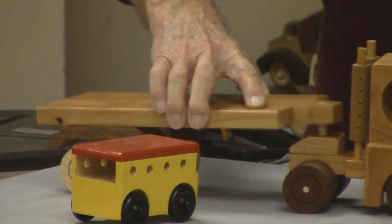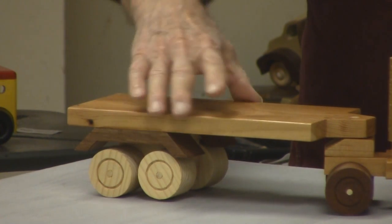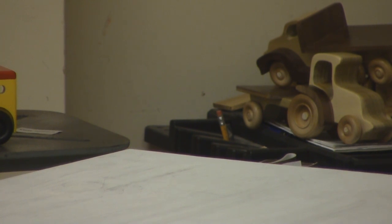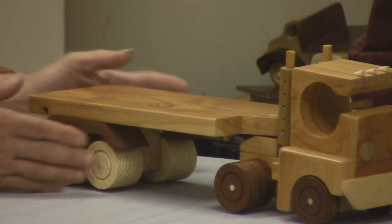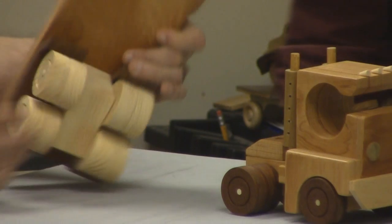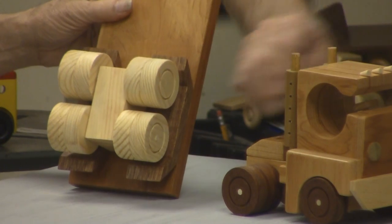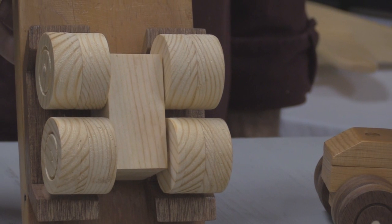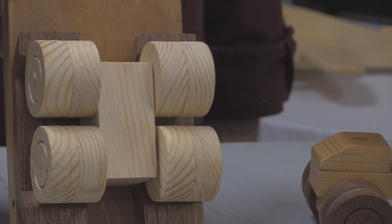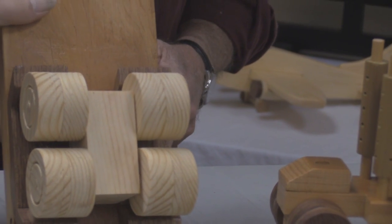And then I made this one from a pattern out of a magazine. And I made the wheels. He didn't buy those. Put them back up there again, please, sir. He did not buy those wheels on Amazon. No, I made those. I just cut them out with a hole saw. Take a smaller hole saw first, cut your kerf, and then cut the wheel itself out. How many people have used a hole saw to make wheels? Okay, but for those that didn't, if you don't have them, it's a way you can do it.